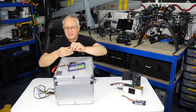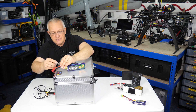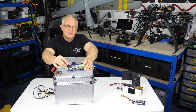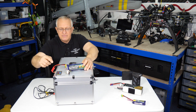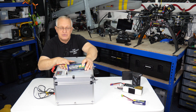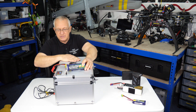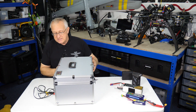We put a low battery warning indicator on it. Plugging that in like so — there you go. That's protecting the cells; it gives me a warning at about 3.2 volts per cell minimum. So we've now got a temperature of 21.1 degrees. That will keep everything topped up and warm for quite a long time. If we're away from the vehicle we just plug one of these batteries in, and we know that when we're ready to fly, all batteries are up to temperature — absolutely brilliant. It's a lovely piece of kit and you'll be able to see some shots of it as we plug it into the vehicle.